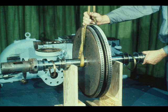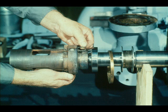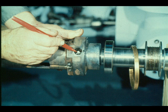Make sure the governor case is in an accessible position, since the next step will be to reassemble the overspeed trip and the constant-speed governor. First, the overspeed trip pin is lowered into its fit in the governor case — this would include an auxiliary weight if the assembly required one. The pin is then locked in position with a U-lock staple, which limits the travel of the pin. With the staple holding the pin in place, the shaft may be rotated 180 degrees, exposing the opposite end of the pin.